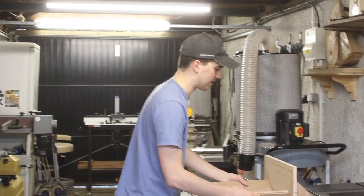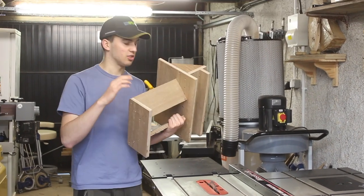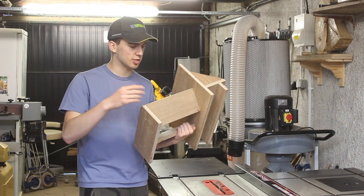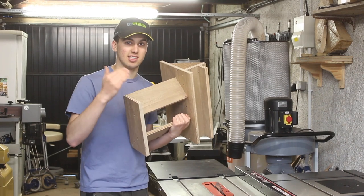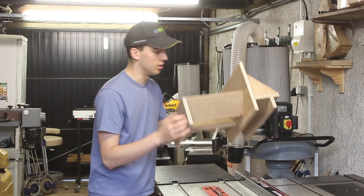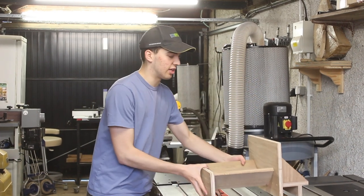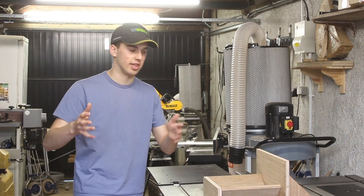It's been a few days since I made this jig, and there are a couple of alterations you could do. To prevent chip-out, I'm putting masking tape on the corner where I'm cutting the spline. Whether you have a zero clearance board behind it, it's still a very good idea to add masking tape. It might also be a good idea to carry on these walls down to the bottom of the table, so you've got a bit of supporting material behind whatever you're cutting to prevent chip-out.